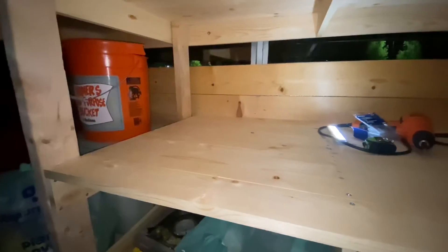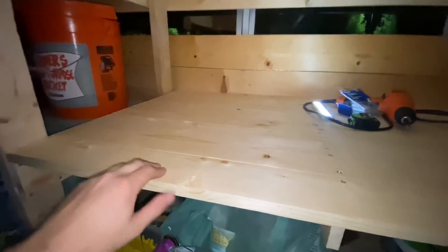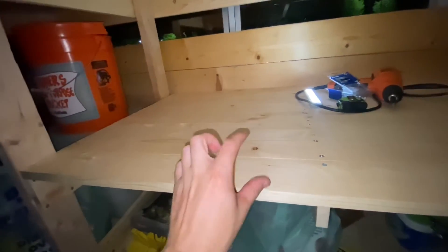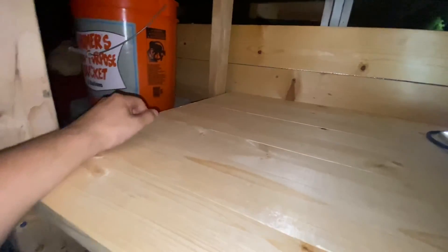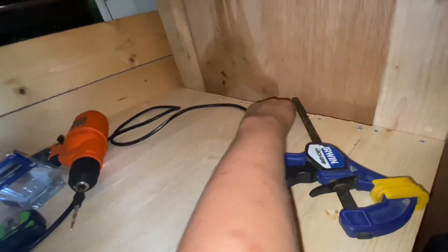I actually have a couple of metal brackets, so I'll also screw the table to the floor as well — just to make sure it doesn't run off when I'm going around a corner. I have this entire shelf pretty much done now. It just needs a couple of pieces to stop things rolling off and to stiffen the edge of the shelf. Right now it feels okay, but it's just not that stiff in the middle and it's not going to hold a ton of weight. I really need something to help support that weight, and that'll be that piece on the edge here, plus bolting it to the wall. I'm also going to have a piece on the interior to keep things from sliding off that way, although I'm not really sure if I'm going to put a piece there or not — mostly larger objects are going to be sitting on this shelf, so I'm not too worried about things sliding off in that direction.